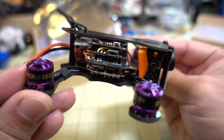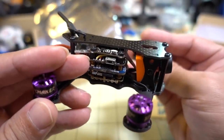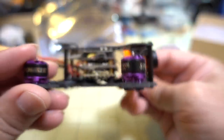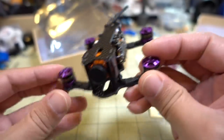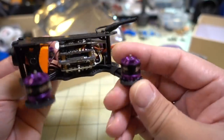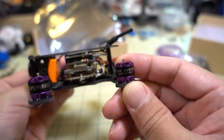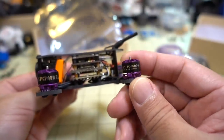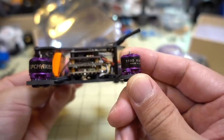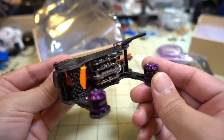Here's a look at the drone — got a single stack. You got your Split Mini board, your F4 flight controller, and your video transmitter. This one's a FlySky version, so there's an RX2A Pro micro receiver in there. It also comes in FrSky and Spektrum versions. SPC Maker branded motors, 1105 6000 kV — these look like the BBB motors, probably one of my favorite motors for 2.5 inch. I've never tried this motor on a 2-inch but it ought to be fine on 3S.